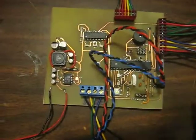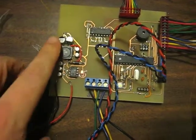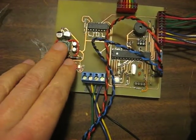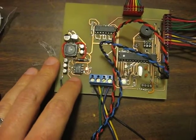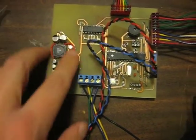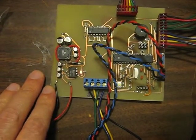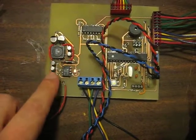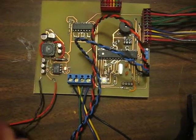Getting back to the exterior unit PCB, I'd like to take a walk around the circuit here. Over here you have a switching power supply. At Bucketworks it's a 12-volt system, so a 7805 got a little too hot for my comfort, so I made this little guy off of this switching chip. There are a lot more capacitors here than really need to be. I just didn't quite have the exact values handy. So these four are all in parallel, filtering the output. These three are in parallel, filtering the input, and then that's the inductor right there.